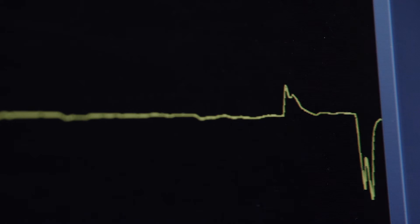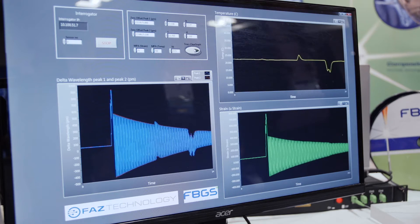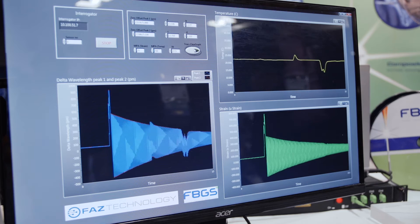Let me show you how the temperature has affected the upper trace without affecting the lower strain. As you see on the left-hand screen again, there's a blip as the temperature is being applied. Now if we go back to the lower screen, you don't see the effect of the temperature on the strain measurement, while it only shows up in the upper trace.